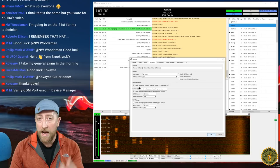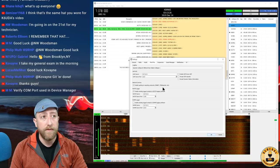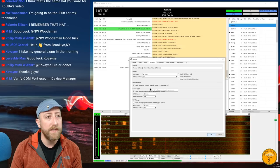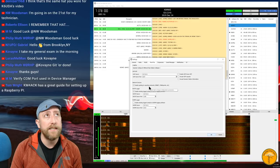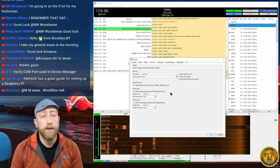Under Reporting, I like to upload contacts and stations I hear to PSK Reporter, just like with FT8, so they get a spot on who's hearing them. Also, verify your COM port in Windows Device Manager — bring it up and make sure you're connected to the port running the Icom driver or whatever driver your radio uses.